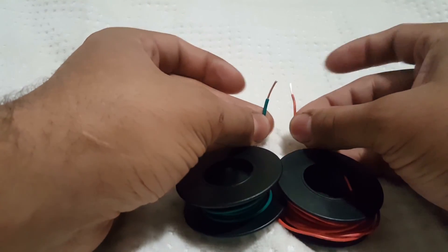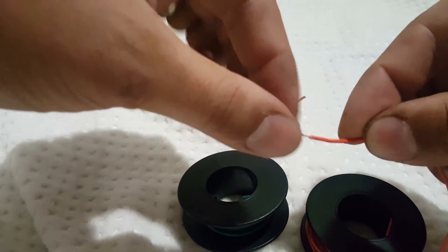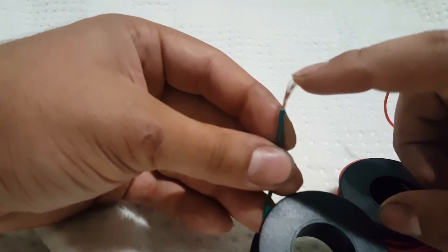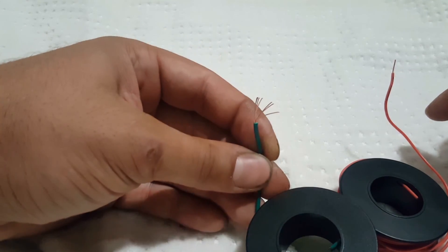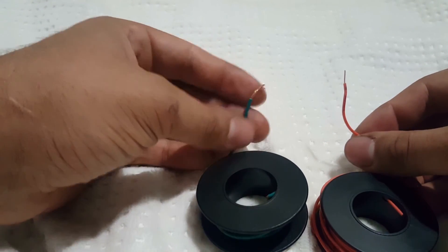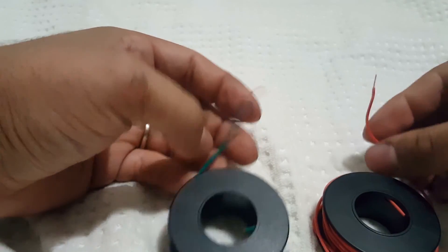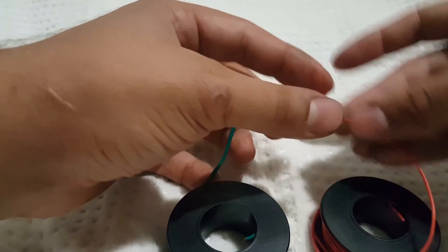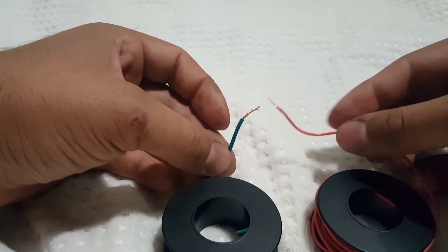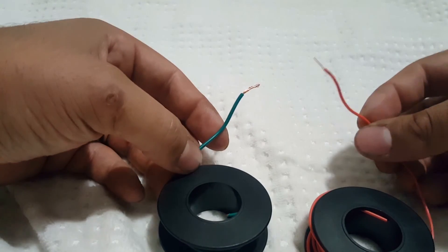You have two types of wire. You have solid core, which is this one right here — this wire is just one single wire. And then you have stranded, which is this one, and you can see it has multiple pieces in it, twisted together throughout the length of the wire. When doing your own wiring, stranded is better to use because it's a lot more flexible and has more surface area, so you can put more amps through it. Solid core is a lot more sturdy — normally used in housing — but if you flex it too much it will eventually break, whereas stranded can flex a lot more before it breaks.